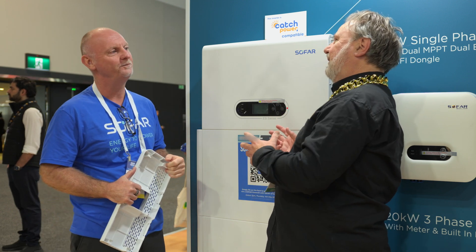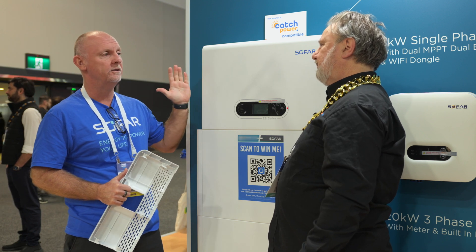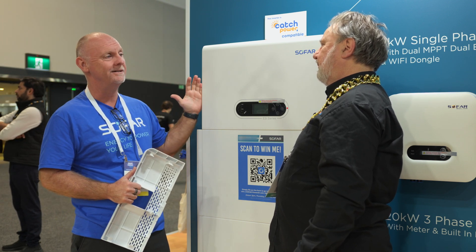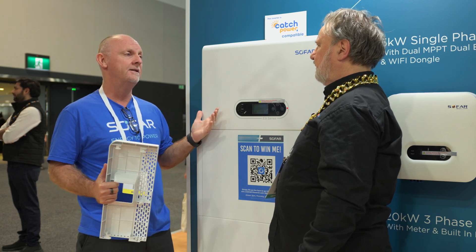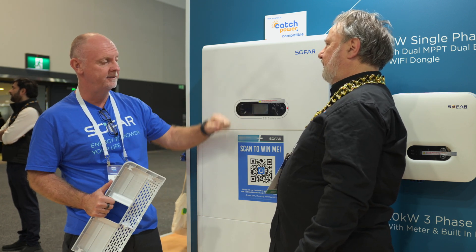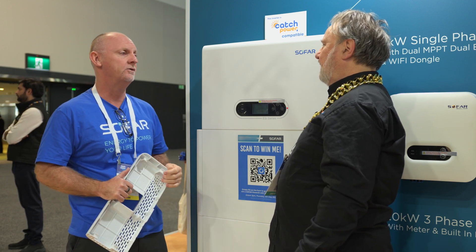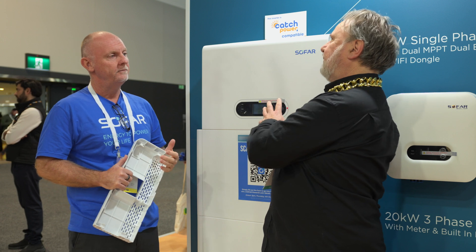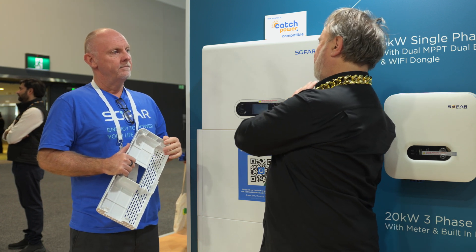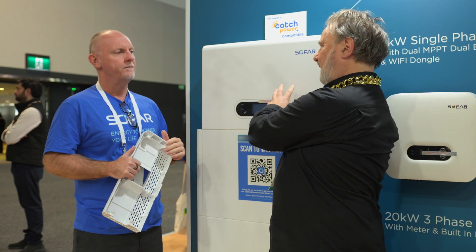If you've got more than one, how do they interact? They parallel, so on the monitoring portal it just looks like one system. So if you've got a customer who wants 10 kilowatts of AC, you could put two of these with a couple of batteries on each — 10 kilowatt AC and anywhere from five up to 60 kilowatt hours of storage. Say you've got limited roof space, you can just size up the PV for one input for your primary parallel.